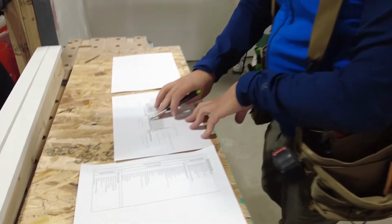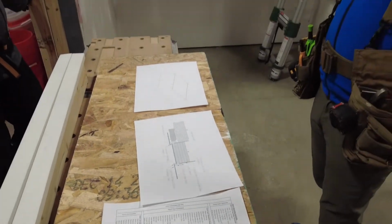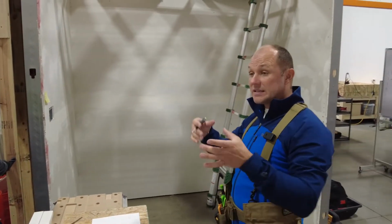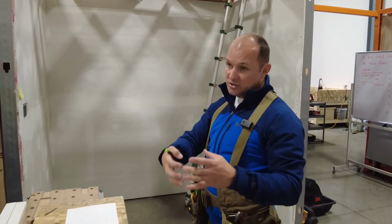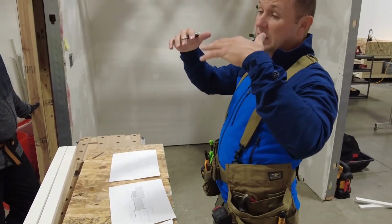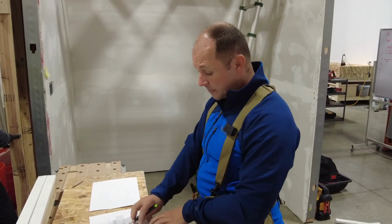But now if we just have one piece of plywood here on the hatch, that's ice cold. The warm, moist air from the hallway or inside the unit, it's going to touch that. It's going to be a condensing surface. So it'll be like an iced teacup out in summer. The moisture in the air will hit that, create moisture, beads of water, right? And what happens is that sucks the moisture up in the drywall or the plywood, mold, mildew, icicles, it rains, things like that. And it can be significant.